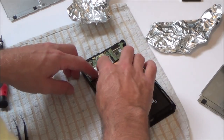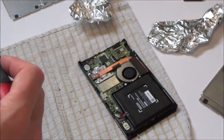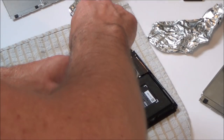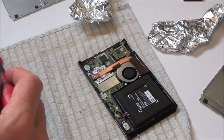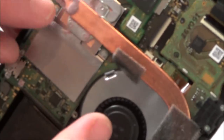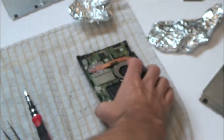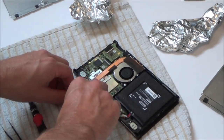Okay, well, it feels kind of nice. It definitely feels like it's moved outwards when you put it on. Now, because I took the Joy-Con rails off this one to fix my other Switch, I'm going to have to make sure I take the Joy-Con rails off the bent Switch and put them back onto here. All I can see is oozed out on the side there, there, there and there. So I think that was probably the right amount to do. So now I need to do the Joy-Con rails.